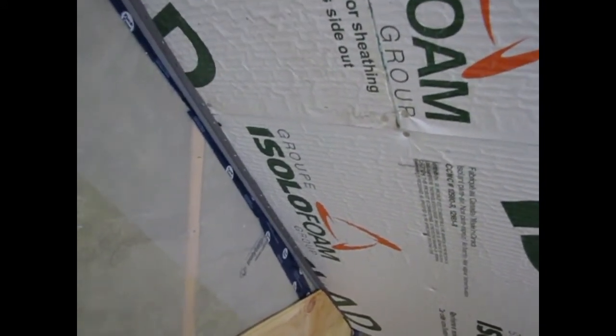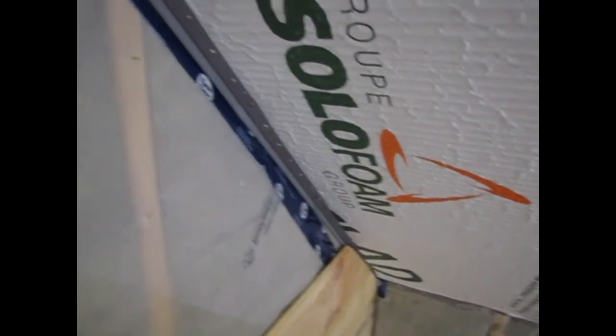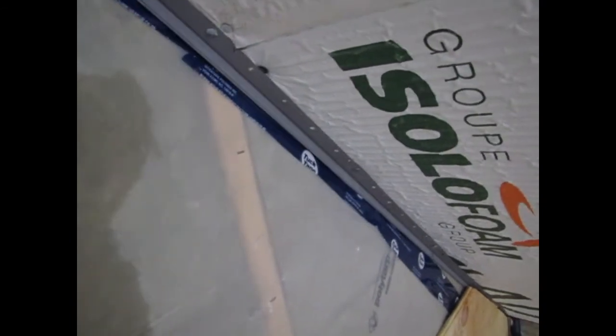So I just wanted to point out here, you don't want to compress insulation. You don't want to have to cut it around a 2x4. Now, because the pine goes up against here, if it was drywall, it'd be the same thing. I guess with drywall, you can tape the corners and that would hold that. The problem with pine is, if you have nothing here, the boards can be floppy, and when you put the boards coming in from the side, you can start pushing them in. So how to keep it straight?